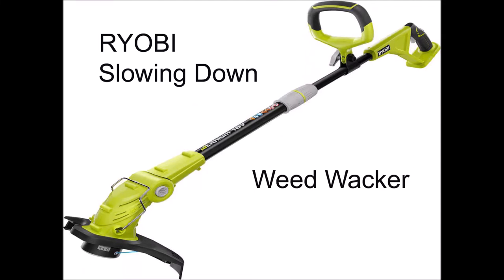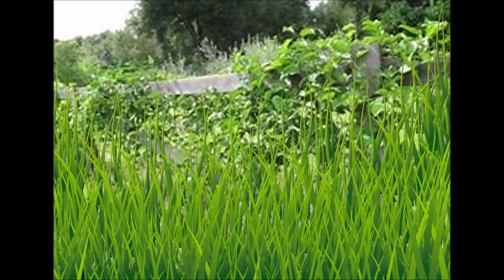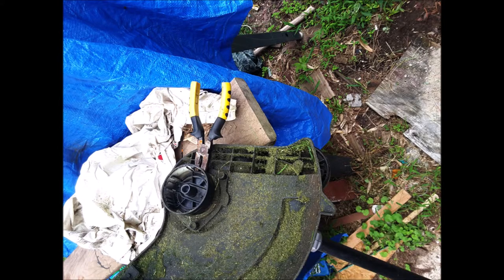This is a short video on how to keep your electric or gas-fired weed whacker up to speed. What happens is that when you try to cut tall stringy grass or things like vines, they tend to wrap around the base of the spool axle. By using needle nose pliers, you can get in tight and extract the tangled grass in small bite-sized pieces.